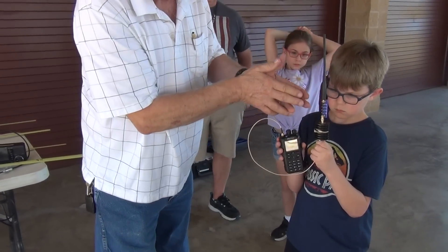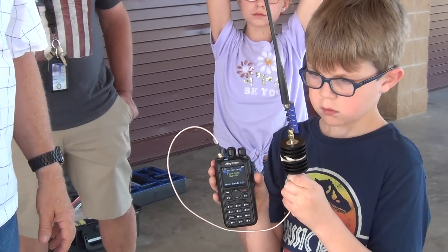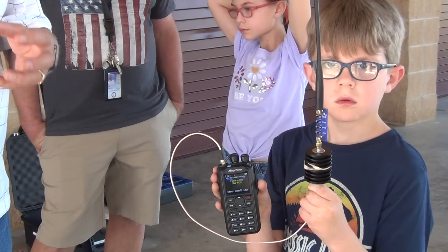This is an adjustable attenuator — specifically a 40 dB attenuator normally used with a spectrum analyzer to cut down the signal coming in so you don't burn it out when testing radios. That same attenuator can be used for fox hunting to cut down on the signal coming into your radio, just like it cuts down the signal going into your analyzer. So we're going to go out here and actually practice looking for the transmitter and have some fun with it. Definitely have fun with it!